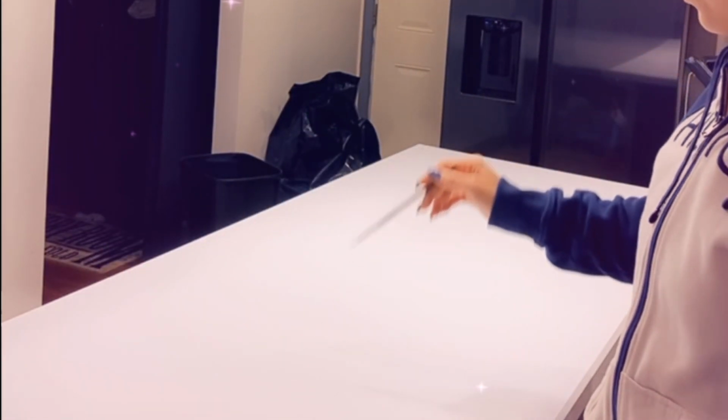Okay, so at this point, I'm going to practice my marble veins. They give me this whiteboard, this little brush, and some gray paint, and some highlighter paint. This is for veining, gray marble veining. Ultimately you want to look as natural as possible. Start from the corners, light brush. I want to start over there first so I can get more practice, and then I'll move on to my center, which is going to be the focal point of the room. So I have to make sure it's perfect. So I'm going to start over here, and then I'll show you guys what it looks like.